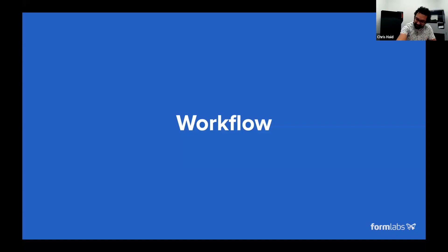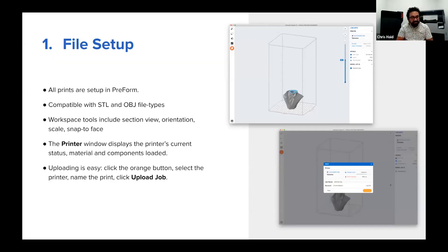I want to step through the workflow to demystify it for those who haven't experienced this before. We start in PreForm, the same software we use for our SLA 3D printers, and we accept STL and OBJ file types. We really take a lot of the technical aspects away so you don't have to worry about speeds, feeds, and all the things that a trained operator needs to figure out over months or years. We try to focus on making this a click-and-print experience. We give you standard controls: grow your parts, shrink them down, rotate, scale in each direction, change orientation. We've also added the ability to array parts and then nest them, so you're optimizing print time by packing parts together efficiently.